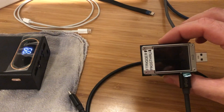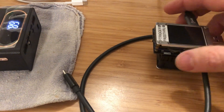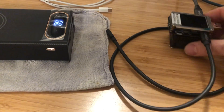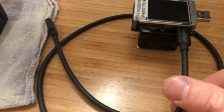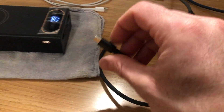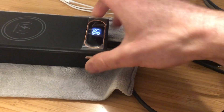To measure that, I'm going to use this meter that is configured for pass-through — meaning it's not triggering or doing any power delivery negotiation. It's merely reading what's flowing through it. On the other side I've got this CalDigit Thunderbolt 4 cable, which is a pretty high quality cable, so that shouldn't influence things, and I'm going to plug that into the power bank.